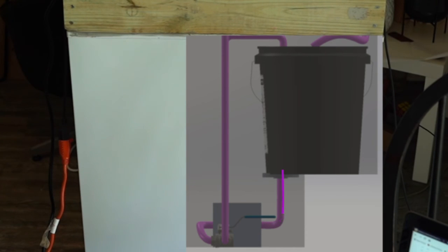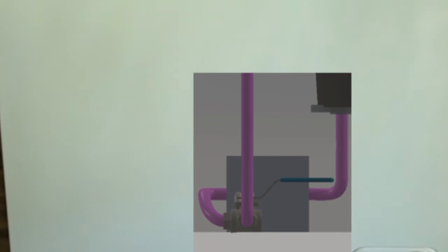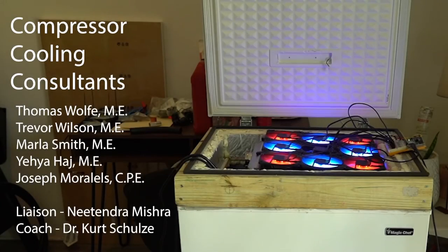The goal of our prototype is to measure the amount of cooling we can get by diverting liquid into the radiator and how much heating we can get by diverting liquid away from it. The more liquid that moves into the radiator, the more cooling we get. The more liquid that bypasses the radiator, the closer we get to the constant heat addition by the immersion heater in the bucket. By controlling fan RPM and valve actuation, we can keep the prototype closer to the set point, reduce the chance of overheating, and reduce the overall thermal gradient in the system.